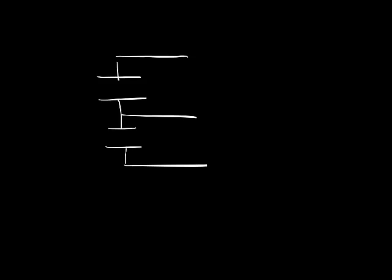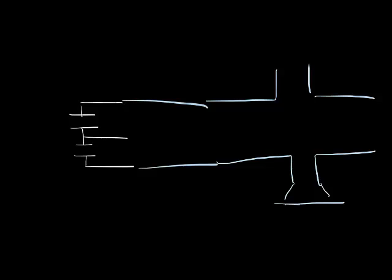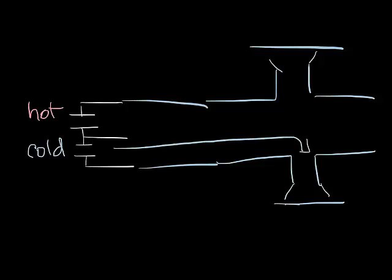You would actually duct the discharge of the complete unit to your diffusers in your space. So there's a challenge to a non-mixing box. Because the hot and cold air streams are not mixed inside the box, you could have cold air going down one side of the duct and hot air going down the other side of the duct. So if you see here, we'll draw in some diffusers. Now you can see the air may not mix and you'll have cold air going to one space and hot air going to the other space.